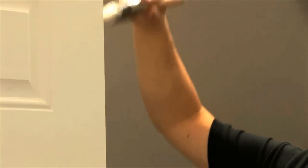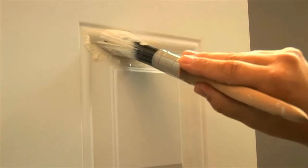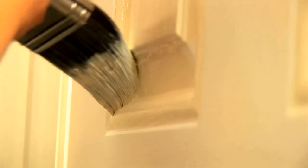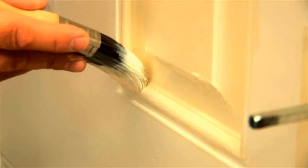When painting with a water-based paint, for best results we recommend that you use a synthetic bristle brush. This will reduce the amount of brush lines and is much easier to apply this type of paint. When painting the panels on the door, just be aware that this is where sometimes you will get little droplets of paint. This is easy to resolve by just picking up with the brush whilst it's still wet.